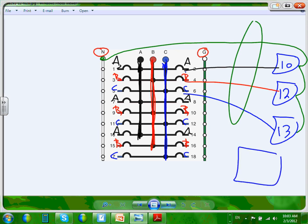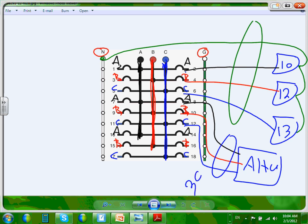If I have an air handling unit, take this. I have my air handling unit, then I'm going to take a three-phase for this baby, and I'm going to go back again from phase A and phase B and phase C. An air handling unit does not need a neutral. They don't run on a neutral. Okay, if they need a neutral, they create it inside with a transformer. There's a three-phase load. You have to understand, this is called the three-phase load.